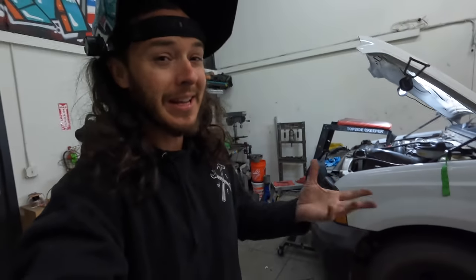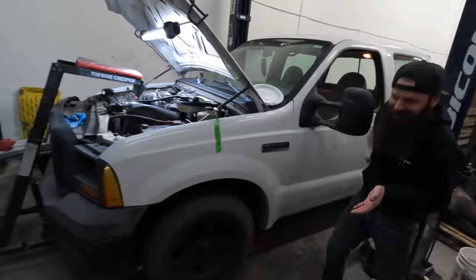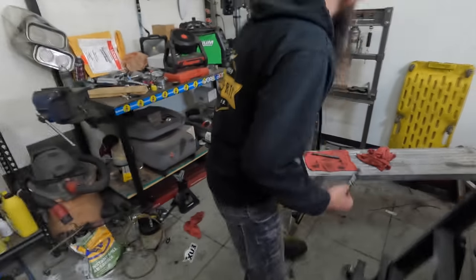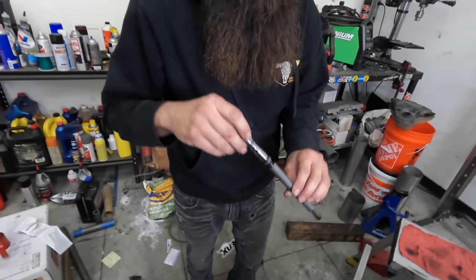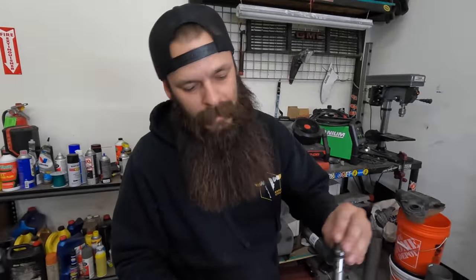Good work. So literally, that entire tearing this thing apart, putting it back together, then tearing it apart again, it was one O-ring? It was just the O-ring? That was it? Yeah. Okay. So apparently, this is the O-ring that goes into the standpipe. So these feed through the oil rail. This goes in there. Feeds in there, and then it seals the whole high pressure oil system to the rail that feeds the injectors. And it blew that O-ring out.